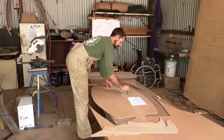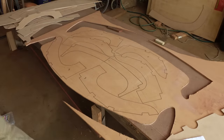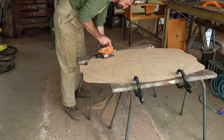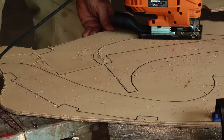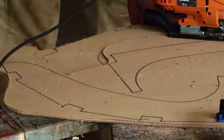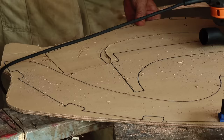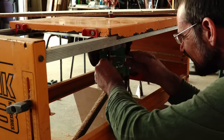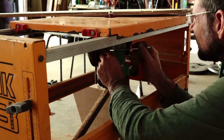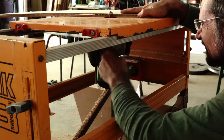With templates, it's a very quick process to lay out the cutting pattern on plywood pretty efficiently. Marking the outline in black marker doesn't affect the accuracy of the final component, despite the line thickness, because the router makes the final precision cut. Cutting with the jigsaw goes very quickly. I try not to cut closer than about 6mm of the line to prevent the ply from tearing out on the jigsaw's upstroke cut. I cut the MDF templates on a quarter-inch router, but for the much thicker, harder plywood, I chose to install my half-inch router.